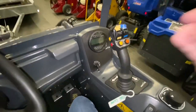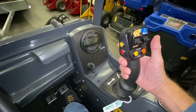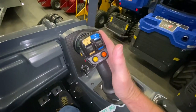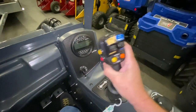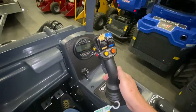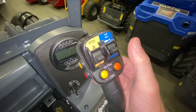The same goes for all controls, especially your joystick. With all the functions, these are all proportional. You lift your boom by pulling back, lower your boom by pushing forwards. You crowd the headstock away by pushing away from you, and crowd it back towards you by pulling towards you. This is multifunctional and multi-positional — you can do both boom and crowd functions together. Get used to feeling this rather than throwing it around. Telescope is this switch here, which is a spring return — telescope out, telescope in, release to centre and it will stop.